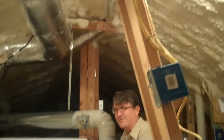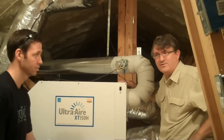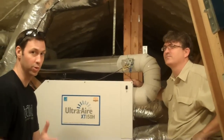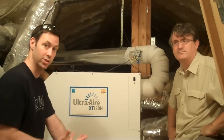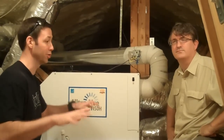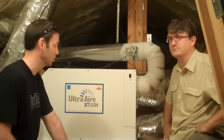Attic spaces in Texas generally get into the 140–150 degree range — super hot. But here we're maybe only five or so degrees hotter than the rest of the house. This is really the way you need to build an HVAC system in Texas in this hot, humid climate — by bringing the ducts into the air-conditioned space of the house. The difference in attic temperature could be as much as 50 degrees cooler in here compared to if we had insulated at the floor level and run all the ducts up into a hot attic. That's our number one rule when talking about HVAC systems.